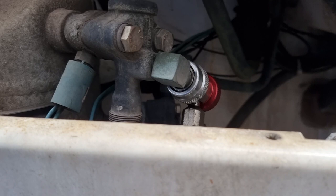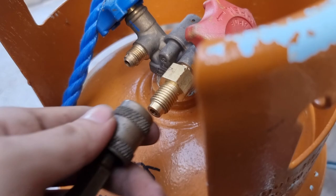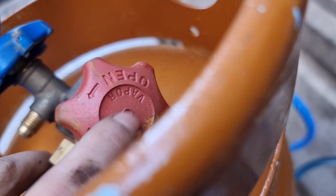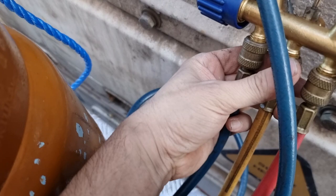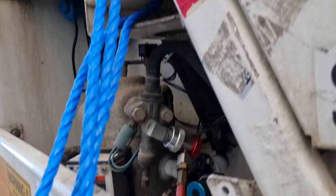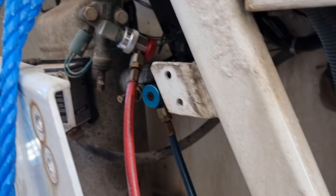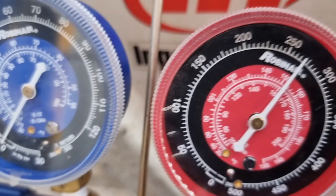The first thing I did was to connect a manifold and compare the local manifold gauge to our controller gauge, to ensure we are really reading around 16.1 bar pressure — we cannot remove the chance of a controller problem giving wrong information on discharge pressure. After connecting, the manifold showed around 265 psi, or around 17 to 18 bar. Having high discharge pressure and low freon level on the sight glass only means we have air in the system.